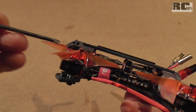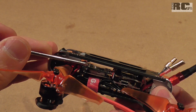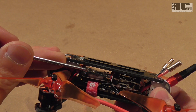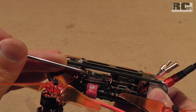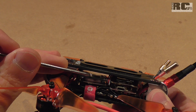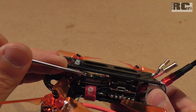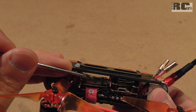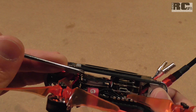The RC receiver I installed is the modified Futaba FAST receiver. This is fine for small spots, but in an earlier test I found the range is only about 300 to 400 meters, so I'm going to swap it for an FHSS receiver to see if I can improve the range — my FHSS receivers normally reach around one kilometer.